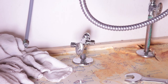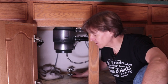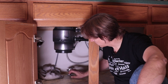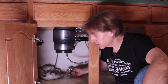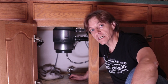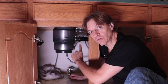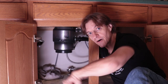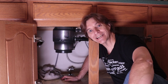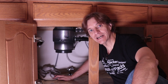Make sure the valves are closed and turn on the main water. Okay, that was a bit exciting. I made sure before I turned the water on to have the valves all turned off because I haven't hooked up the inputs or the outputs yet. What I failed to do was turn off the faucet up above — it was turned on in the middle position, so when I turned the water on the cold water side got pressurized, went up through the faucet out the hot water side, and came out through the unconnected connection. Lesson learned: remember before you turn the water on to turn off the faucet if everything's not tightened up and buttoned up down below.